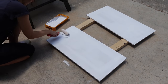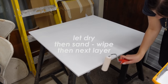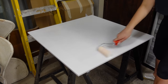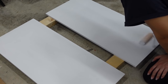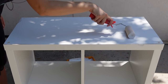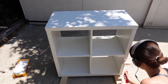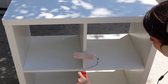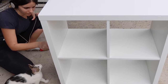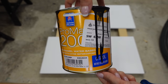That day the weather was all over the place — when I started painting it was sunny and hot and everything dried within minutes, but then it started to rain heavily so I moved everything into the garage until the rain stopped. For the Kallax unit the process was very straightforward. I applied primer on the areas I'll be painting later — I won't be painting the interior — for a total of two coats, sanding between coats.